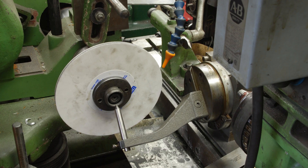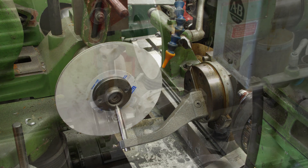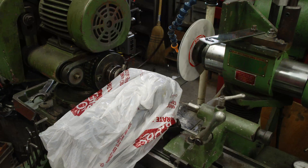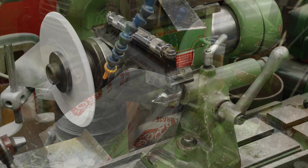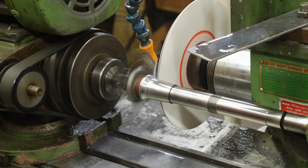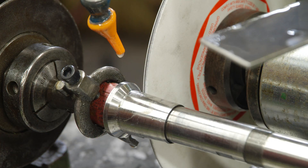To dress the wheel, first I have to make sure that the dressing tool is at the center height — meaning that the motion of the angular dressing tool is going to be in a vertical plane going through the spindle axis. I set this up by eye as shown in the photograph. A diamond point is mounted, and when I'm ready to dress, I put the whole angular dressing attachment inside a plastic bag just to keep all the grit out of the motion. We've got a nicely dressed wheel ready for grinding. I can't traverse the work with the wheel, so I'm just going to kiss it, and then I'll mount the work in the lathe and polish it with a hard Arkansas stone. The hard Arkansas stone takes about nothing off, but it'll just knock off some of the high points if there are any.